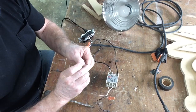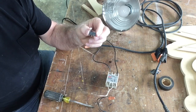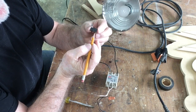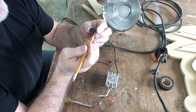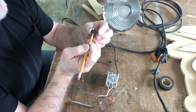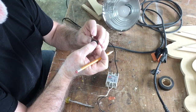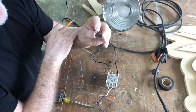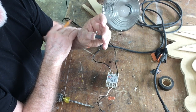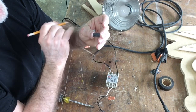What I want to do is attach the micro switch into the circuit. On the micro switches, you have three different pins. One is common, usually separated from the other two, and then you have a normally open and a normally closed. For my application, I want it so that if the circuit is closed, the machine is off. When the blast gate opens, the switch will turn on and allow the central vacuum to run.